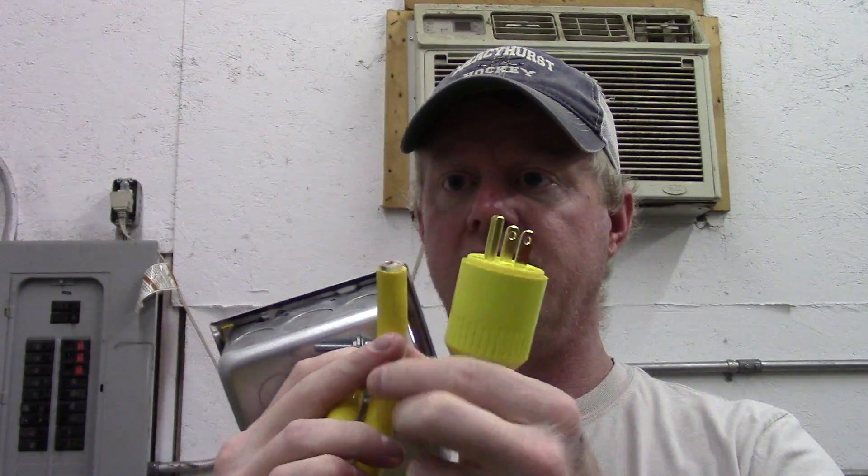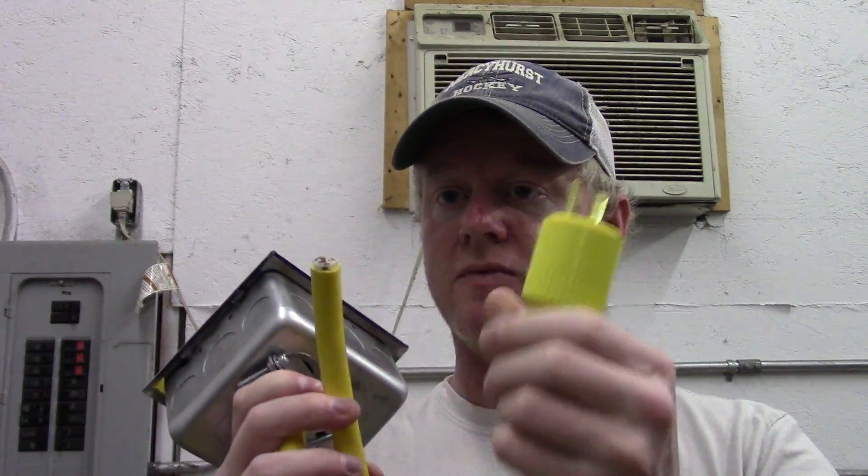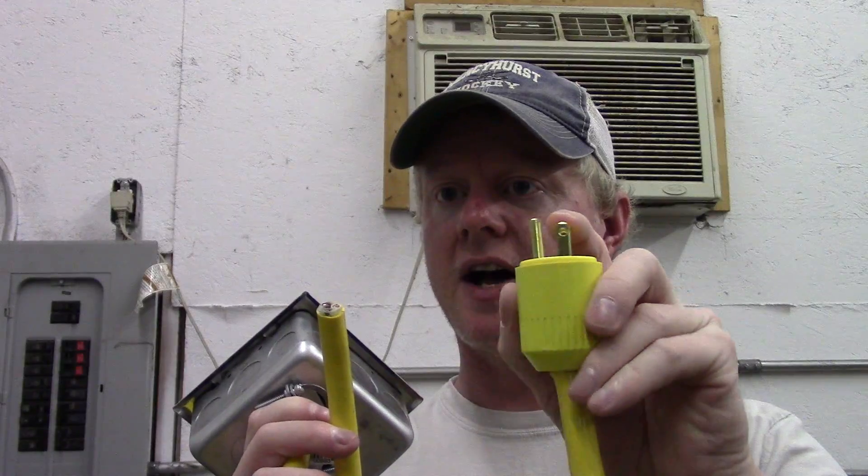You end up with two male connectors, and this is a 50-amp plug. I'm not going to be able to supply 50 amps with the generators I have, but this allows me to not have to have any other adapters. This is still safe and protected, other than the fact that if you don't follow the directions and you have one of these unplugged, this end will be hot when the generator is connected on the one that's unplugged.